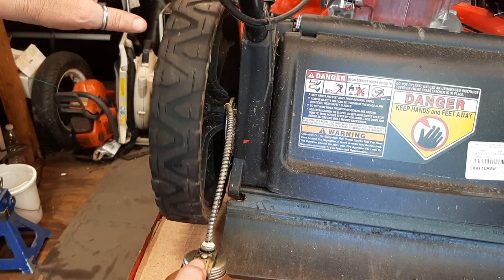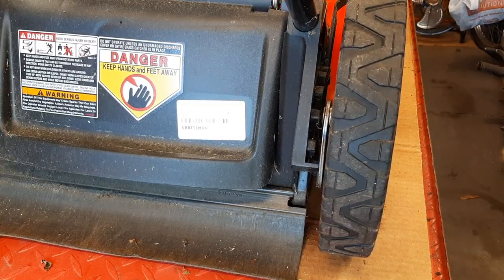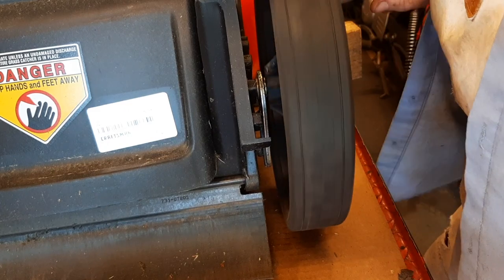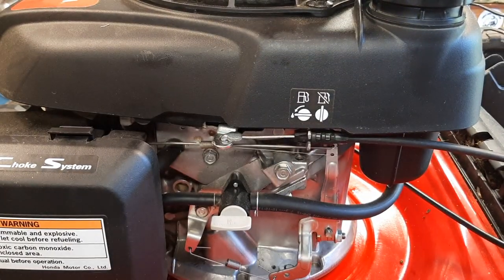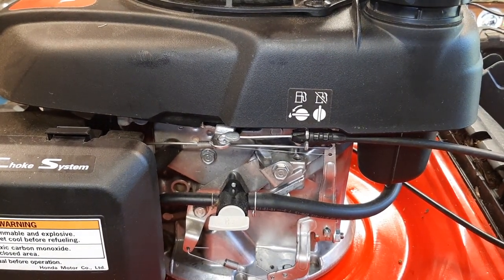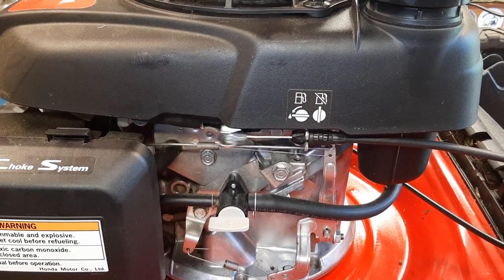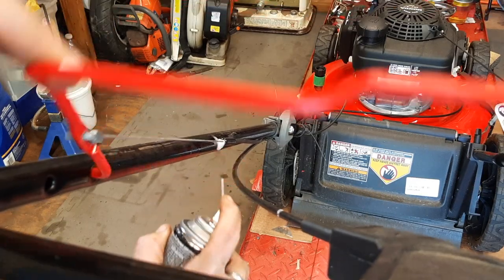A little lube on the wheels — just a couple of drops, it'll work its way in there. I'm going to lubricate the operating cables. I use a product called Tri-Flow; the bicycle guys use it, so I trust them. Just a few spritzes in there and it will work its way right up in the cable. Operate that a couple of times. Same thing on the top end — just a couple of squirts, operate the bail a couple of times and it will work its way down in the cable.